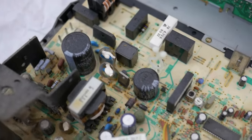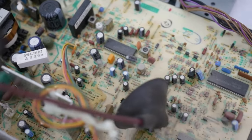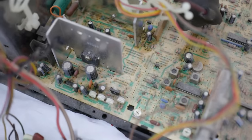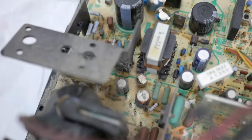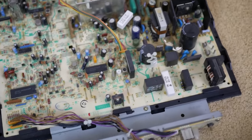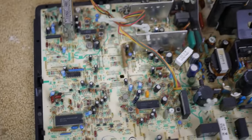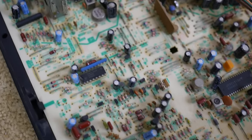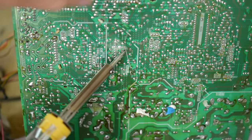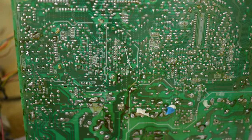This was when I started to notice the board was more than just dirty. Upon closer inspection, it seemed to have been caked with what was likely corrosive capacitor juice. It was hard to even tell where this stuff was coming from because no capacitor seemed to be obviously leaking - it was just all over the place. I cleaned off as much of the gunk as I could with a toothbrush, but it really would need a dishwasher or a hose to be cleaned properly. Anyway, I carried on replacing capacitors and got pretty much all of them, but left a few of the bigger ones, which may have been a mistake. Replacing what I did made no difference, so I started looking at other parts of the board.